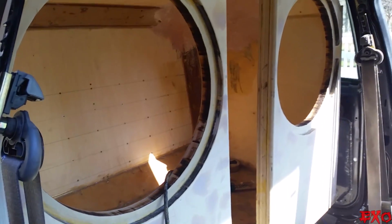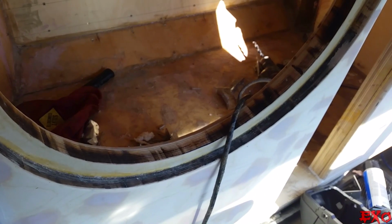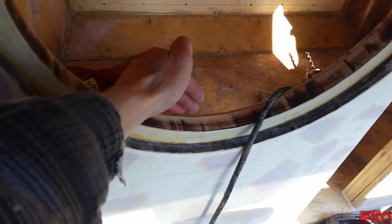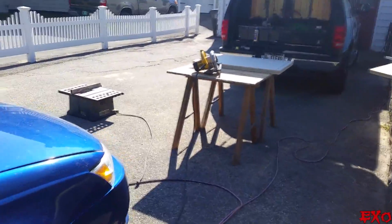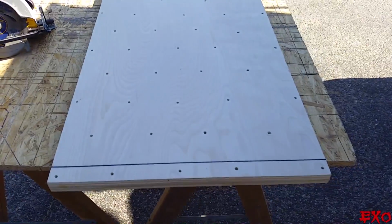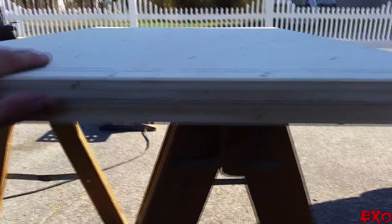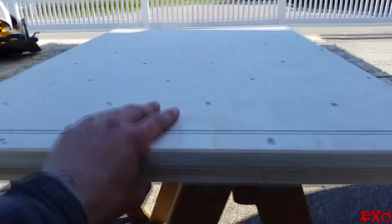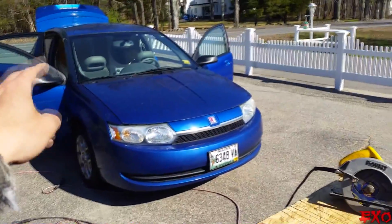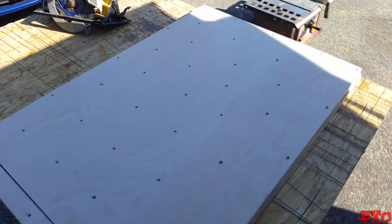But we're going to have a quick change of plans. We're going to make the baffle slightly thicker. Twice as thick, actually. We're going to add another 2 layers right here in the back. We're going to step it up about another 1.5 inches back here just to make this thing indestructible. And last night, I went ahead and took the time to drill them together before I make the baffles just to make it a little bit easier. So we got it all lined up and lots of glue in between these layers here. So we're gonna cut the same exact baffle all over again and then go up from behind and tack it in real strong. So that's what we're gonna do right now.